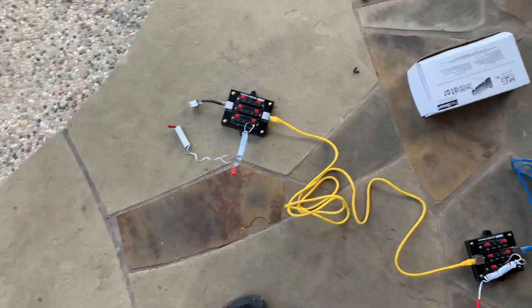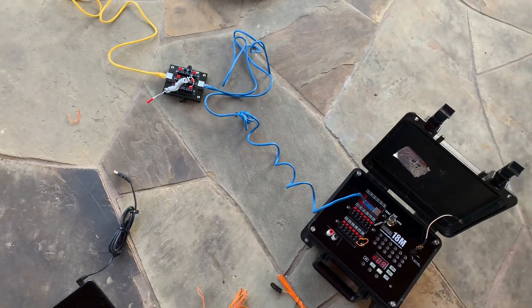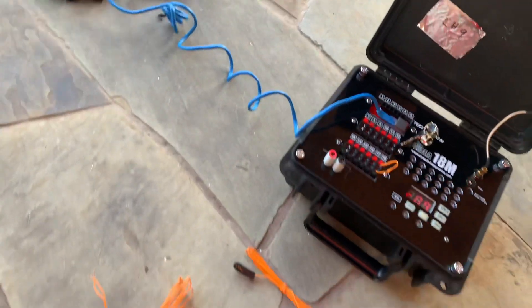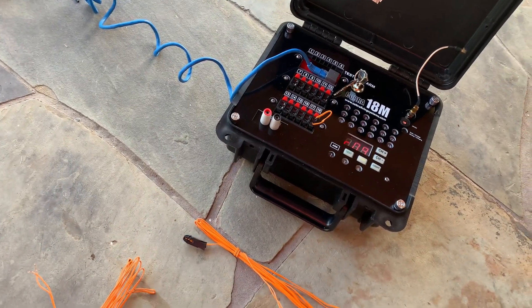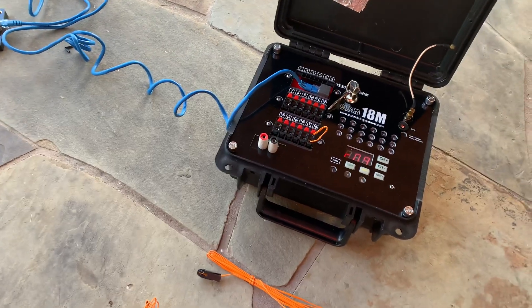Also that little black wire that comes with that shunt — that's a crossover style cable. So don't try using that as a connector between any of these mini slots, even if you're testing. I know it's super short and it's kind of convenient to use something that short when you're just testing, but that one is a crossover and it's wired basically flipped on either end, so it will not work as a connecting cable like a regular Cat5 or Cat6.